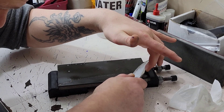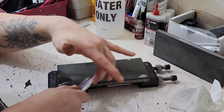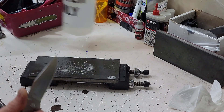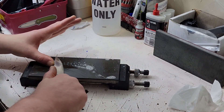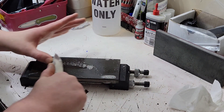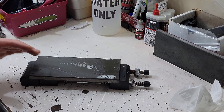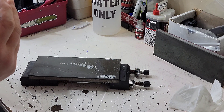My plan isn't to bring this to a very high grit, but getting it on the stone and setting the bevel — that's always the longest part of any sharpening job. This took maybe a little bit longer than normal knives on average to set the bevel. But because it's incredibly hard, it's actually easier to hold and develop an edge bevel because it's not being mushed around. A soft steel is always the hardest to sharpen in my opinion. The diamonds seem much more effective on a high HRC or a well heat-treated knife.